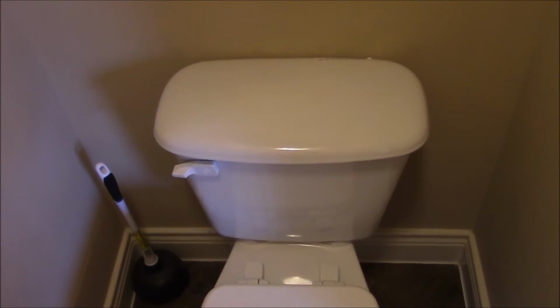Here's the toilet tank with the tank lid on. Just to recap a couple key things, I was able to hand tighten the supply line to the fill valve, and also attach the fill valve with this plastic washer underneath, if you can see that. Attach that by hand. The ones for the actual screws that come out, these look like they may be plastic, can't quite tell, or they're not silver at least. But I used a wrench with a 1/2-inch screw that comes with it.